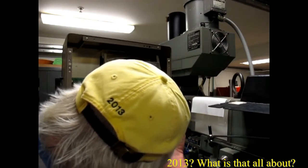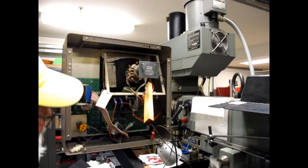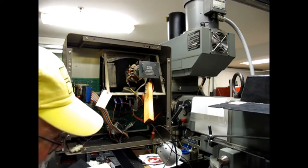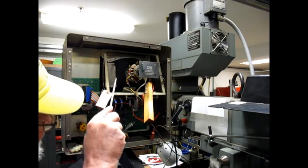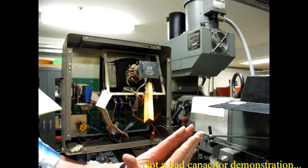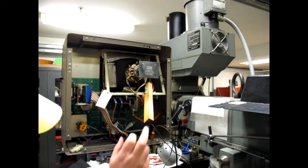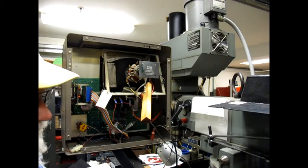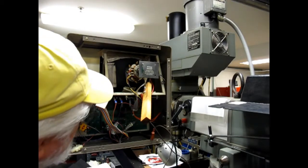Okay. We can leave that there because it takes a while for the high voltage to drain down out of this conductive coating on the outside and another similar coating on the inside, which together with the glass acts as a capacitor. And it takes a while for the charge to migrate around to the anode cap. And it will recover. I mean, it'll pull electrons out of the glass and be ready to zap you years later sometimes.